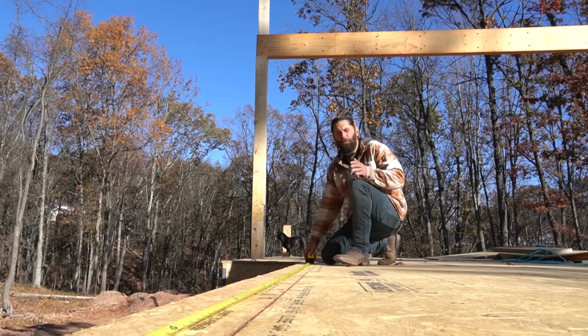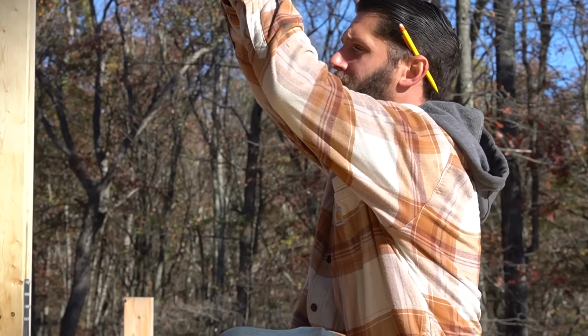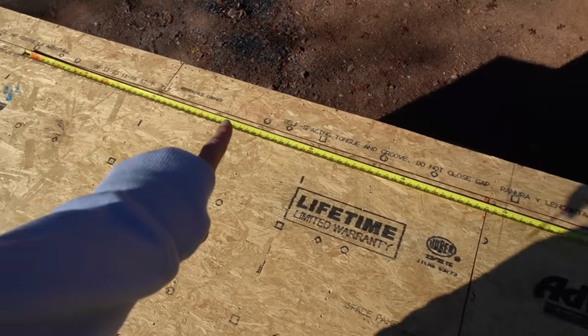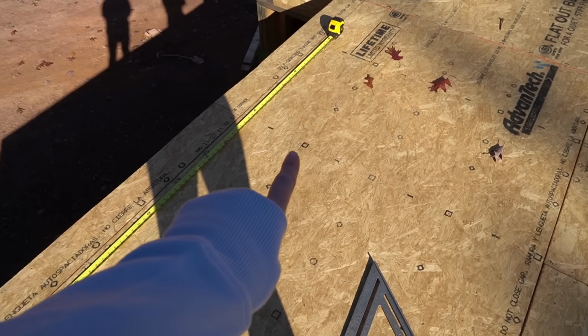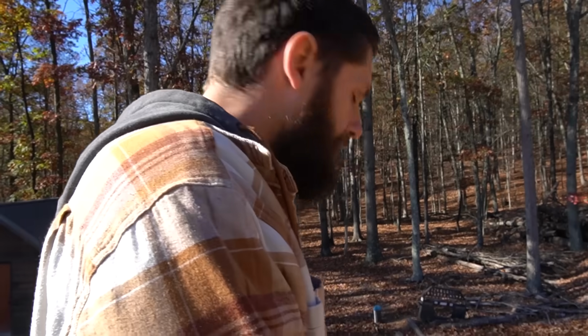We're gonna do the dormer 12 wide. We'll push up the 8-foot wall, and on top of the 8-foot wall, we're gonna have, I guess, triangle style windows over top of the gable. It comes down to just triangle windows and a window wall. Is that what we're going for? I agree. Me too. So this side is only going to be a transom window up high, because this is gonna be the shower. Yes. This over here can be like two individual windows or one window that's actually two windows. Okay. Does that make sense?